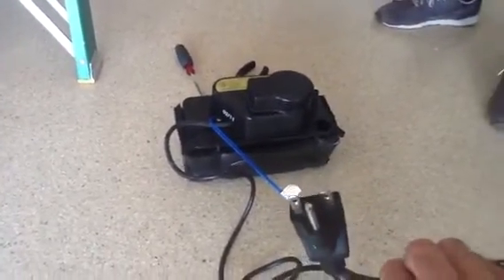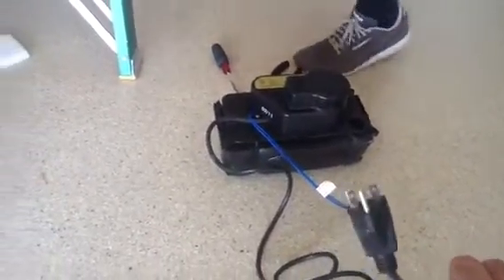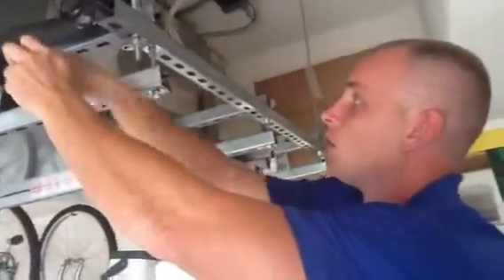What we're able to do is add a receptacle to the air handler. And because we don't need a neutral, we'll tie it straight across next to the disconnect. If you look up there at the disconnect, we have a 230 volt receptacle that we're able to put off the air handler. And that is code.